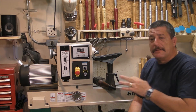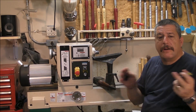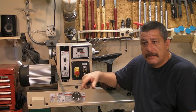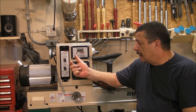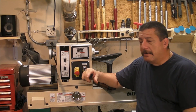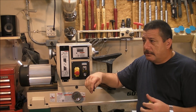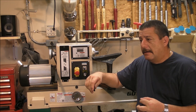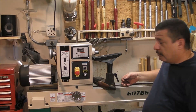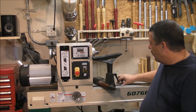After these specifications, I decided to make two blocks — one with the positive thoughts and one with the negative ones. The first positive is that it's a sturdy machine: 496 pounds weight, so it's heavy. I had the opportunity last week to make two big balls with no vibration at all, and I think I'm not going to have to load it with more weight, which is nice. The other thing that most surprised me was the finish of the machine. The bed is absolutely smooth — you cannot see one single mark from the end mill used to set it up. It's absolutely smooth, with chamfering on the sides of the bed, so it's well-made.